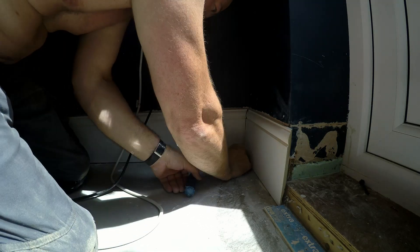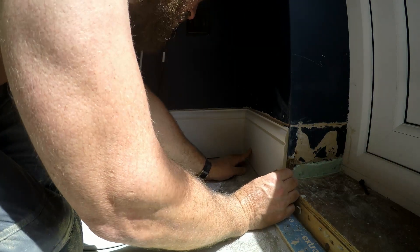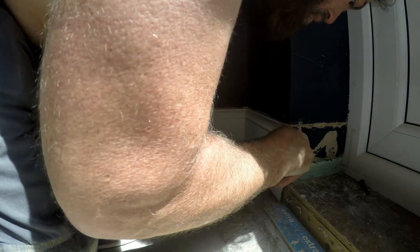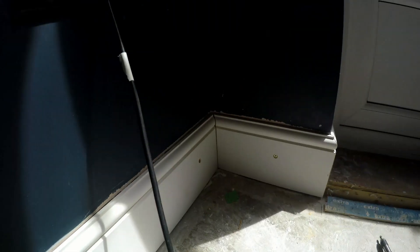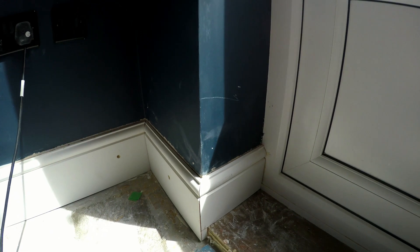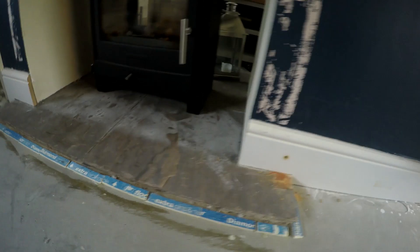We will be caulking. I've actually caulked some of the tops here — very simple process, just run caulk over the top. These are the 45-degree miter cuts, which look really neat instead of just straight cuts, because the miter cut basically keeps the board folded on itself. Caulking the edges is a really important part. Take your time and do it properly — it gives the right finish. Your caulk is a flexible element, and because wood flexes between heat and cold, don't use a filler that doesn't flex on these joints.